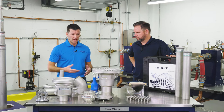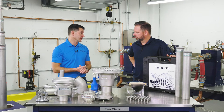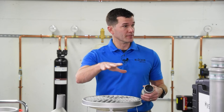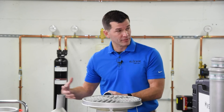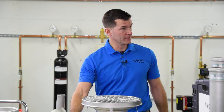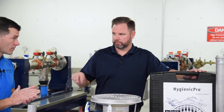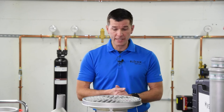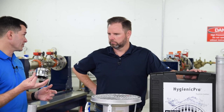From a custom standpoint, we can make saddles that connect from a spigot end. You can go right into your main master line from a butt-weld stainless, welding that saddle in place, and then go through your entire waste facility with Blucher. You can transition off something existing right into the Blucher system — whether from a stainless standpoint with welding flanges, from plastics, or from cast iron using transition couplings.